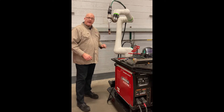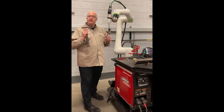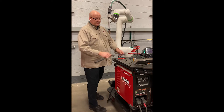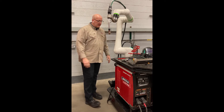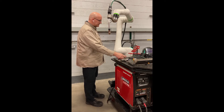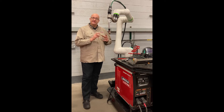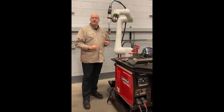You're also going to need either a mallet or, in this case, I have a small punch with a ball-peen hammer. I'm going to just tap the cover. There is a gasket on there that is reusable, but that gasket tends to stick pretty tight, so we'll probably need that to get it loose. I'm going to take the cover off. Underneath there, there's a cage that holds two batteries in place and then there are just two plugs.